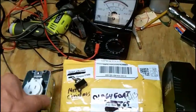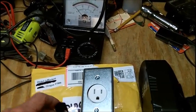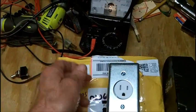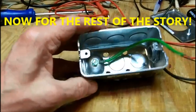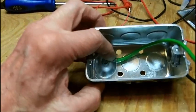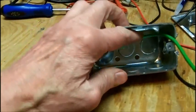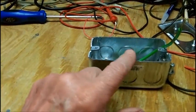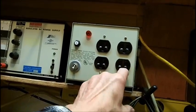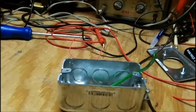Anyways, that's the project. There's going to be a cover on it, and the switch will be on the side. Probably I could put it on the top and mount my light wire on the side. Here's a quick shot of the dim bulb tester socket section. I have an eyelet here with the green grounding screw going to the outlet, because the wire that comes into this from the isolation transformer has the ground prong grounded — not the neutral, but the ground prong is. Because if we want to plug in a piece of equipment that has a ground prong on it, you want to make sure that your ground prong is grounded.